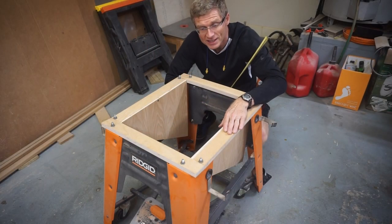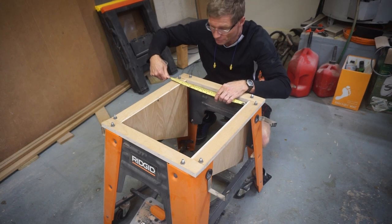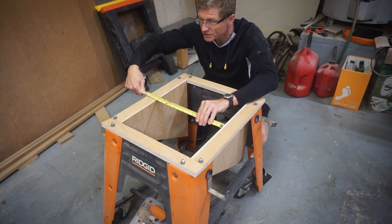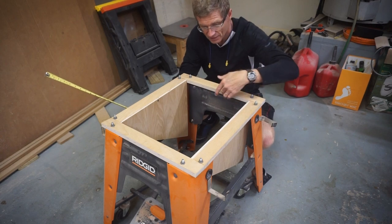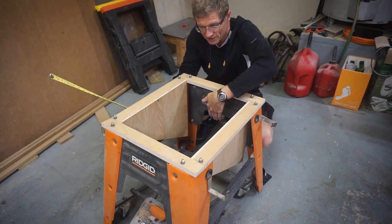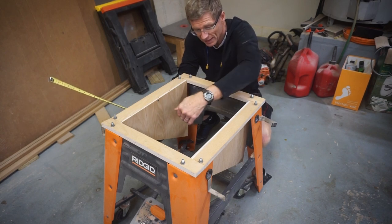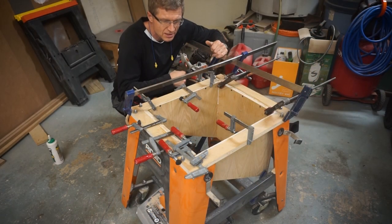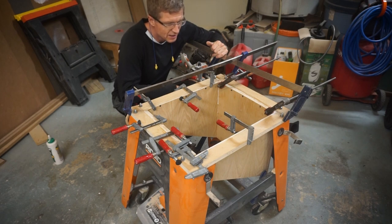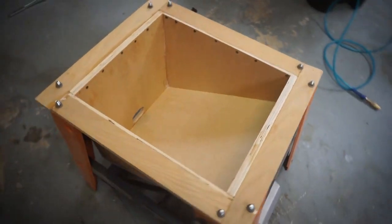I've temporarily installed these two side pieces with drywall screws just to hold them while I measure to confirm the interior dimension. And it is, in fact, 14 and a quarter inches all the way along, just as I had expected. I'm going to go ahead and cut the end pieces — the front and the back. The back one will be 15 inches deep, the front one will be 4.61 inches. I'll have to remember to cut that 60-degree angle on the front piece and the back piece. I've got the side pieces and the end pieces glued and screwed in. Now the last thing to do is cut the bottom and glue and clamp it in place. Alright, everything's assembled — I've got the bottom in and the sides, all glued and screwed.